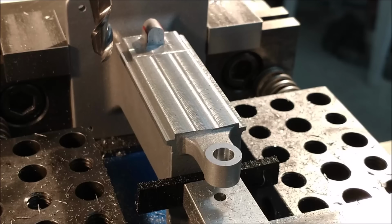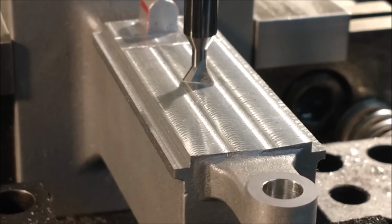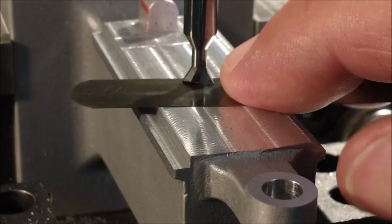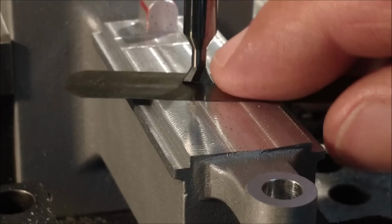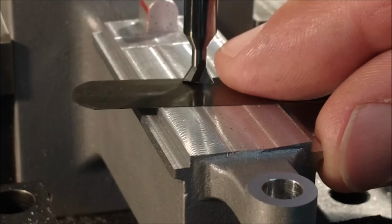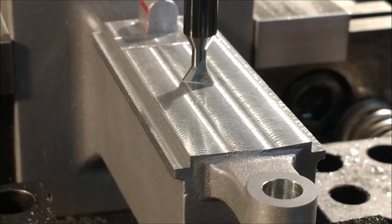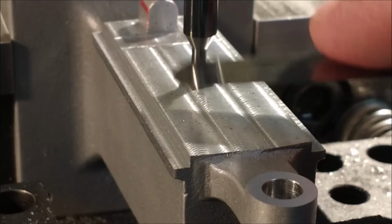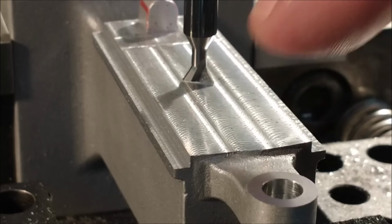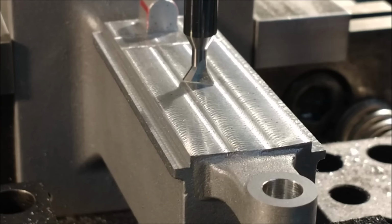All right, let's put a dovetail cutter in there and make the feature and call it a day. No, I just call it a day, call it finished. Right back. The height of my dovetail cutter is being set with a feeler gauge to be 5 thousandths above this surface. The dial on my knee is set to -5 from the zero on the dial. So when the dial hits zero, I know this should be on the surface here. I will not turn this on and get a witness mark here. I want this to be cosmetically pure.